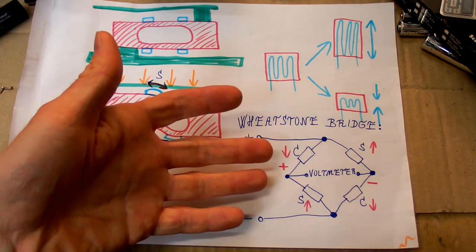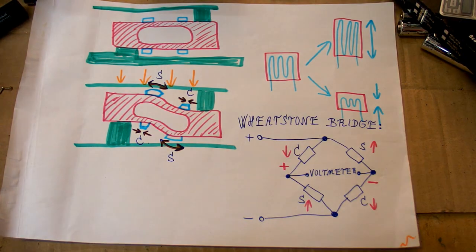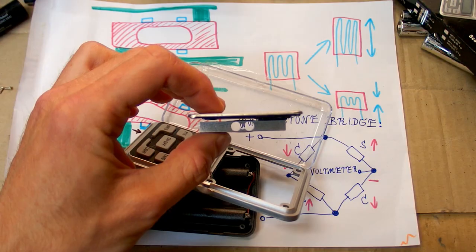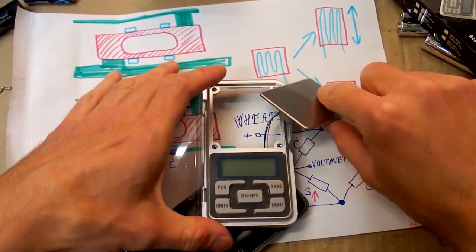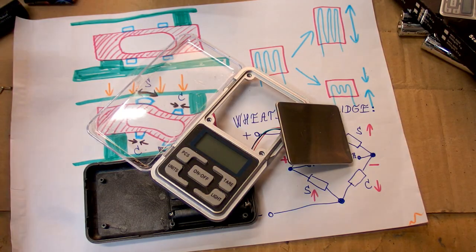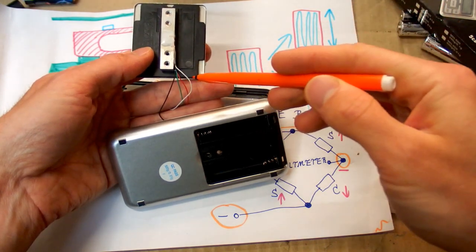So now the bridge is out of balance, and this end of it is slightly positive in reference to this end of it. And then it's measured by the electronics, and the weight is calculated from it. And of course the weight of this plate is subtracted digitally probably, and also you can press the tare button and you can digitally subtract the weight of some other container, of some object or substance you're weighing. So the weight of the container is not included in the measurement,